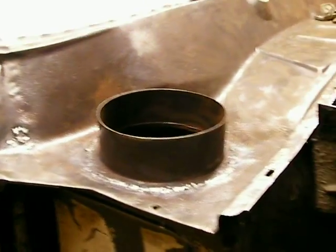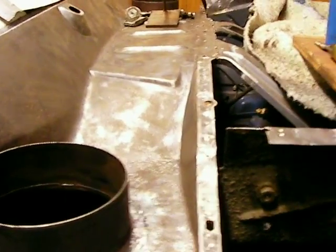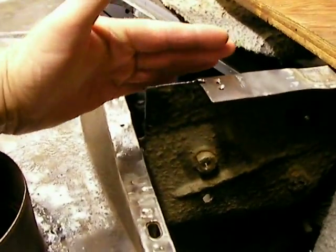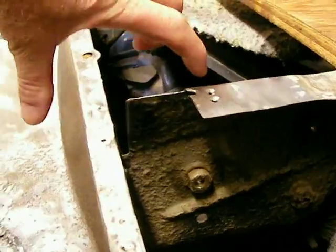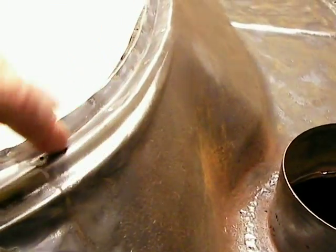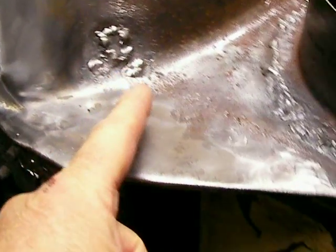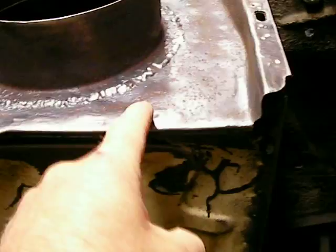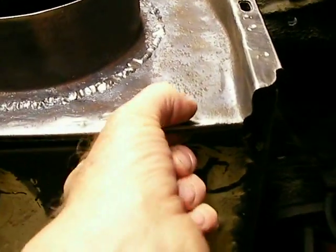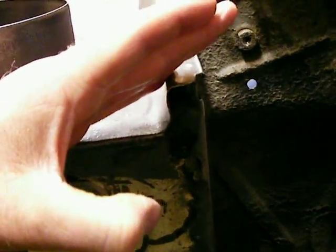There's just the main piece missing off the top here. It's one big panel with the exception of right here — there are a couple little connector braces that are also made out of stamped sheet metal. You'll see those if you pop your hood. But the thing is spot welded on and it sits on this edge right here, and usually there's a little gap behind it. It comes down over here, follows this line, and it's got an outward fold on the bottom where it's thin and it's spot welded on. There's usually pretty much a triangular opening — you could consider that the overflow drain.